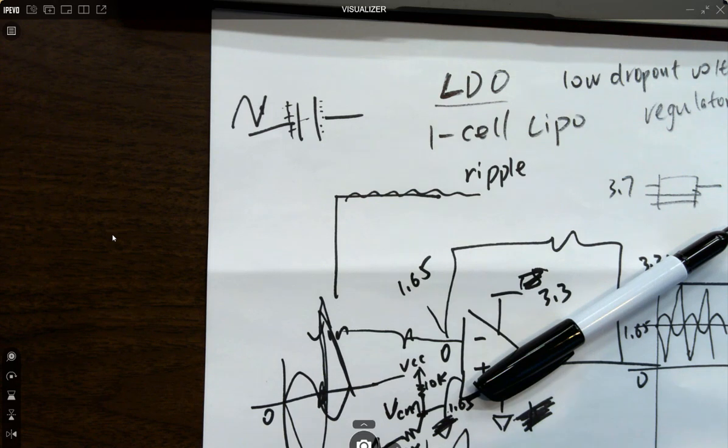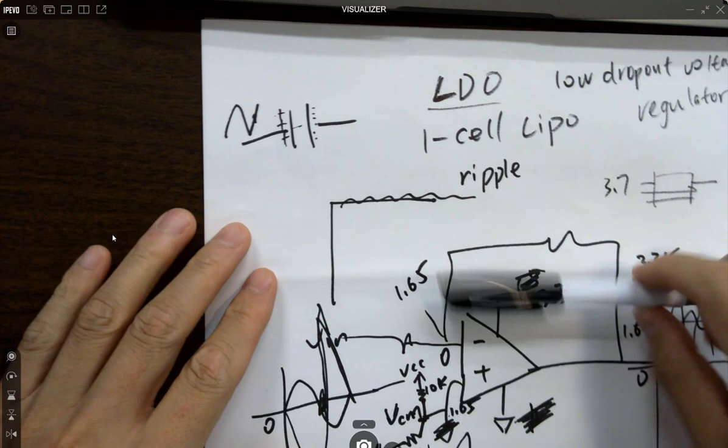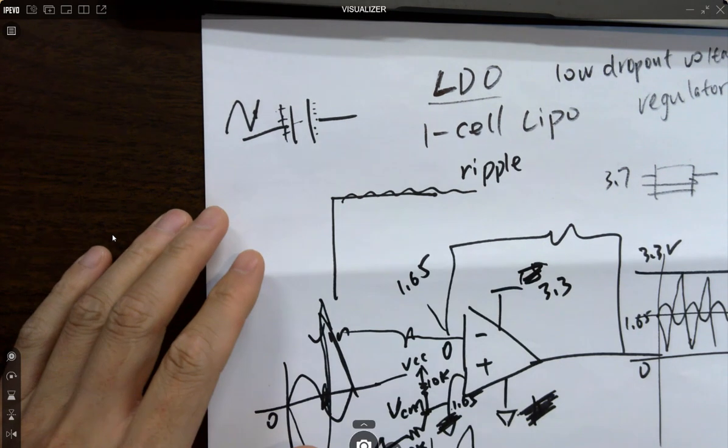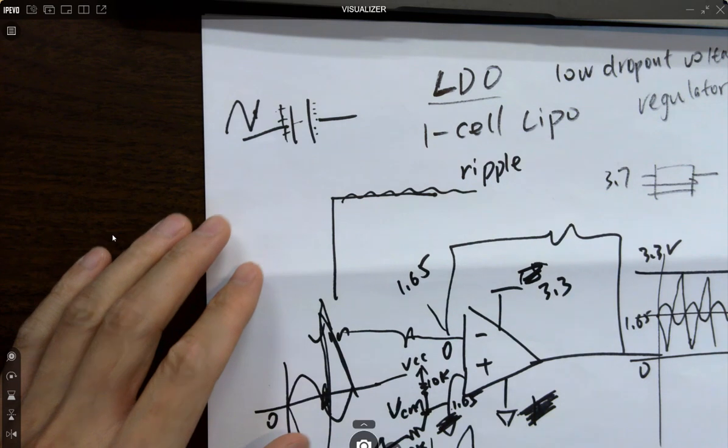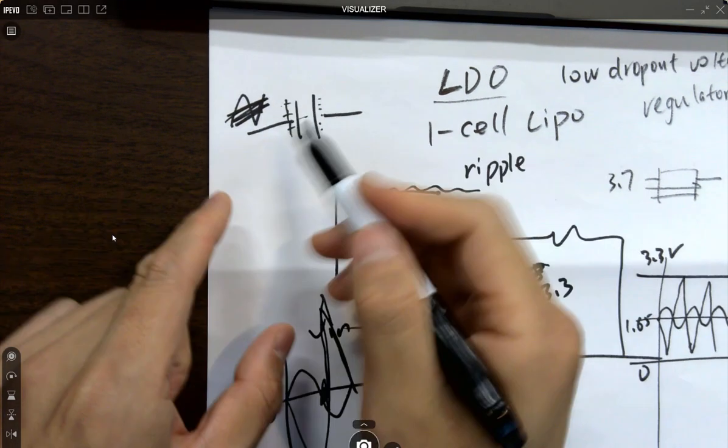So what's really happening is your charge-up is repelling positive charges on the other side. So it seems like it charged up, and on the other side the positive charge is also going away. So it seems like it's passing, but nothing is actually passing. Make sense? So a capacitor can pass AC. That's how that works. But for a DC signal, it's a steady voltage, no current going back and forth.